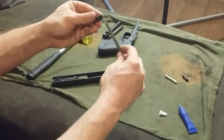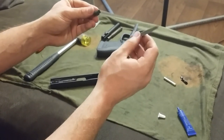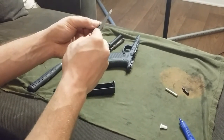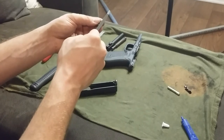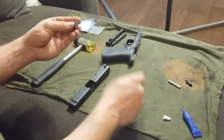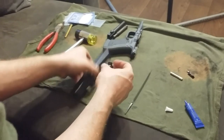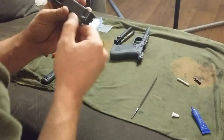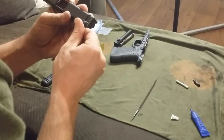What I have here is a triangular Nicholson rasp. They do make specialty ones from Brownells that have a safe side so you don't cut metal on the side you're not wanting to cut. What you're going to want to do is cut into the dovetail to remove the metal. You don't want to take it away from the base — you want to shorten the width of the dovetail as it corresponds to the slot. This looks about good to me so I'm going to start.